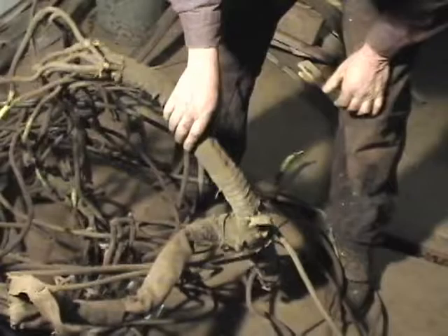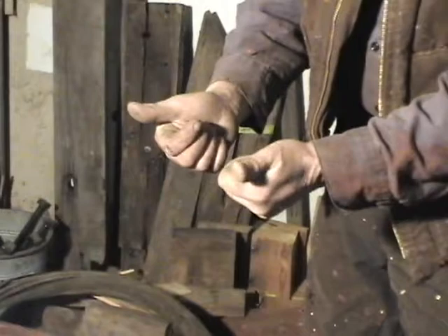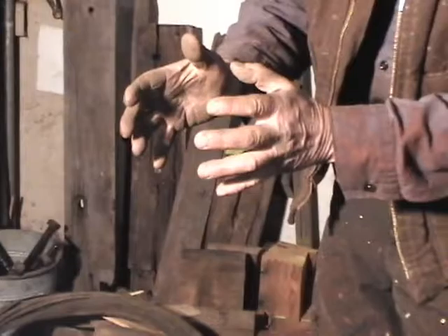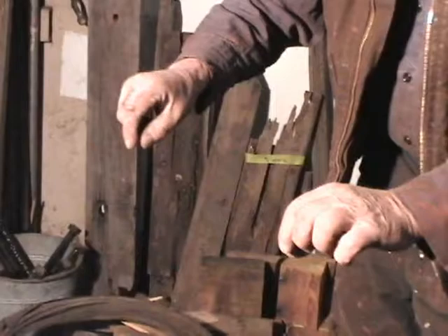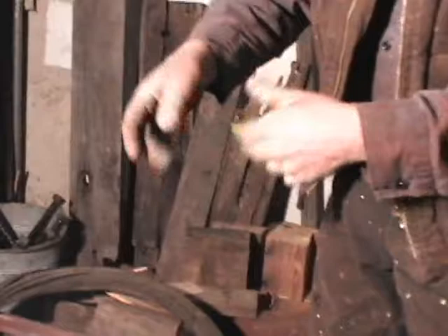This is a big T-splice. Basically you take the stranded wire — you have the straight ahead wire, bare it for about this long, open up and splay out all seven strands, and wrap them very nicely in both directions so that you get what they call a Western Union splice — a T with the branch wire and the through wire. Then you solder that, and it's very solid. Then you tape that all up and it's just fine.